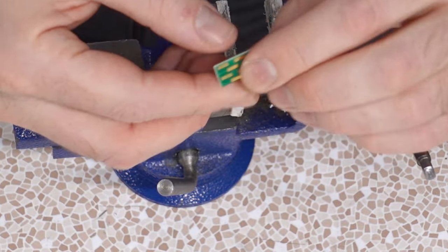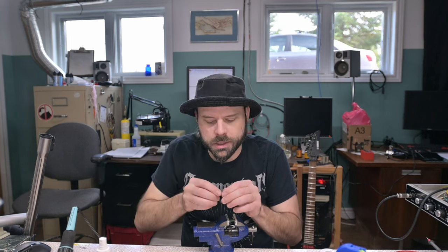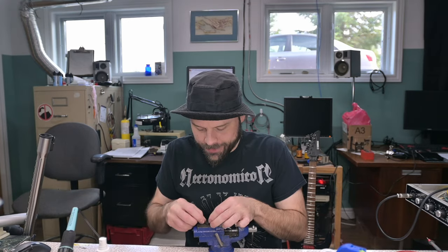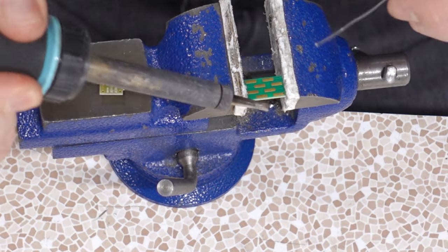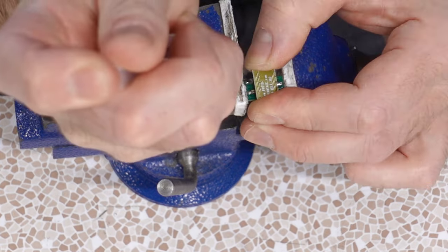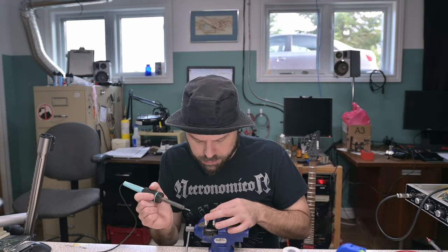Now we have to get the fingers on the bottom. We got to get a four-pack off here somehow — because we have to snip it. I did one of these last time. Break off another four. They give you a jig which is nice of them — that jig's gonna keep your pins properly aligned. Let's tin ourselves some surfaces, seat that on there. Those went on nice. Give her a rotate — it's great because if you already have tinning on there, the flux keeps the solder fresh so you're not brittle-burning it up.